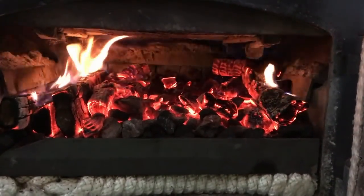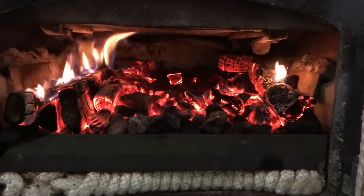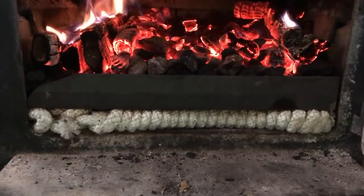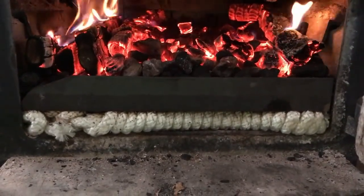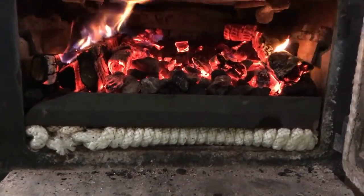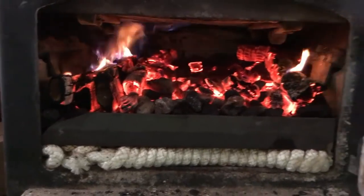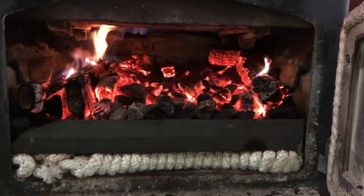This is after the first hour. I've been screwing around with this thing a lot trying to figure it out. I feel I should have a better fire by now, but in the middle where it's mostly coal we do have some good blue flames going. I had some rope gasket — I always have a bunch on hand from doing boiler work — and air was coming up around that piece of angle iron through the door, so it wasn't getting under the coal bed. I stuffed the rope gasket in there and so far it seems to be doing pretty well.